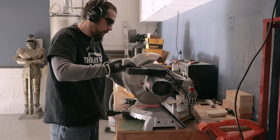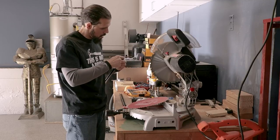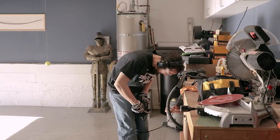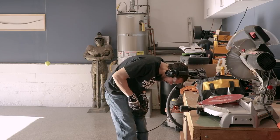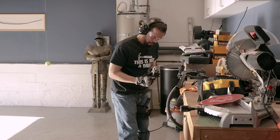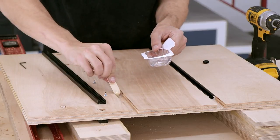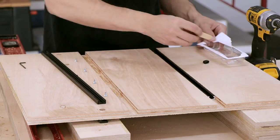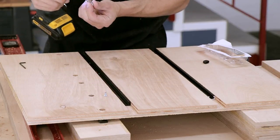These t-tracks are aluminum so you can cut them with woodworking tools — just go nice and slow, then shave off any burrs afterwards because it leaves a sharp edge. The groove for the t-track is really thin, which doesn't leave much space for a screw, so I had to grind the screws down to tiny little nubs so they'd screw in without going below and hitting the surface of the table saw. It would have been easier with a vise, but I made do. To get some extra strength I mixed up some quick-setting epoxy to put down first, so the screws just hold things in place while the epoxy dries — that t-track won't be going anywhere.